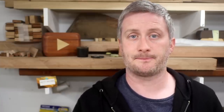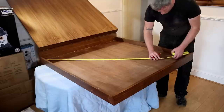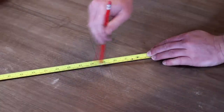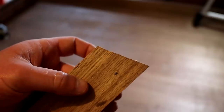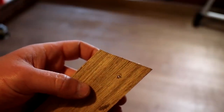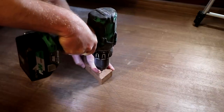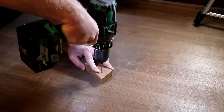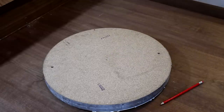Here's the best idea I could come up with. First I wanted to find the centre of the back panel by marking either side of the tape measure from corner to corner and eyeballing the centre point — this didn't need to be perfect, just to look centred by eye. I drilled through a scrap of wood on my pillar drill to give me a drilling guide and used that to drill a perfectly plumb hole through the centre. Then I needed to find the centre of the dartboard — fortunately it came supplied with a centre hole already.